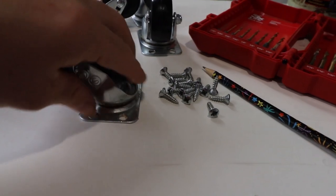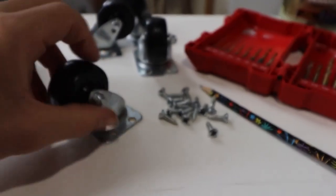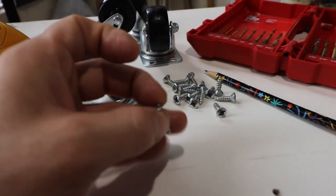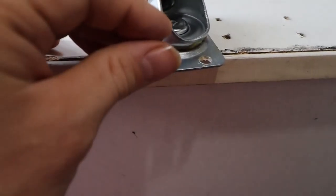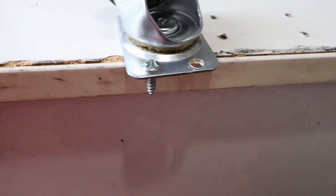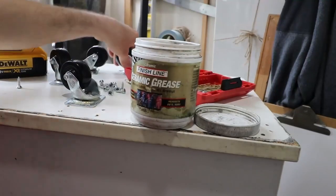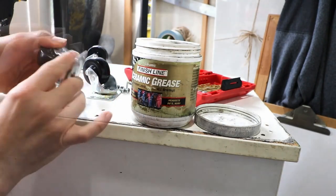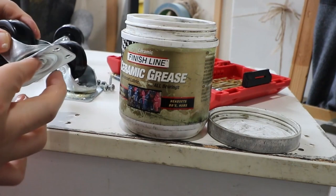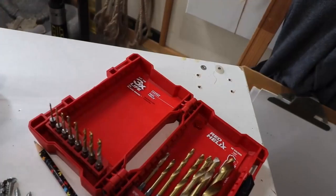I chose a set of wheels that swiveled to increase the mobility, and they have bearings. As for the screws, the wheels have four openings each, that's why I need 16. I picked them based on their heads being big enough where they won't fall out of the holes, and also the screws not being too big where they'll penetrate past the wood. For the grease — totally optional — grease the bearings in the wheels. This is not necessary, but I find that it will make moving your table smoother. I do this because the factory grease is pretty much non-existent.